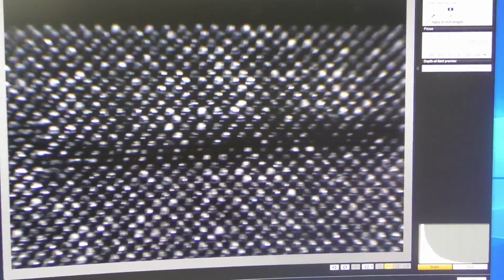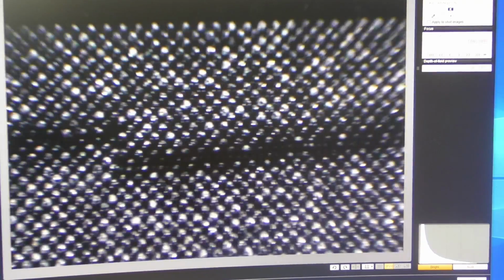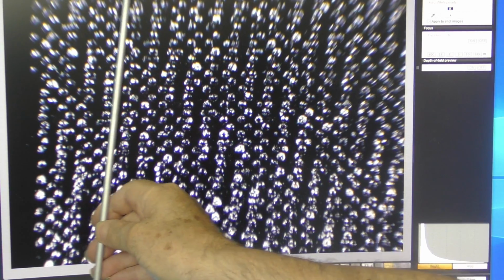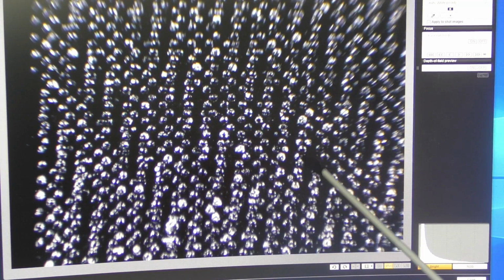I'm going to have to check this pattern now to see what happens when I change away from 10 kilohertz in very small increments. This is the 9 kilohertz pattern. And look, it's got major disruptions in X. They're running across here at an angle, like that, look. So these are actually missing pixels. So it's amazing how sensitive this machine is to having exactly the right frequency to match the pixels. Otherwise we're going to produce these aliasing patterns.